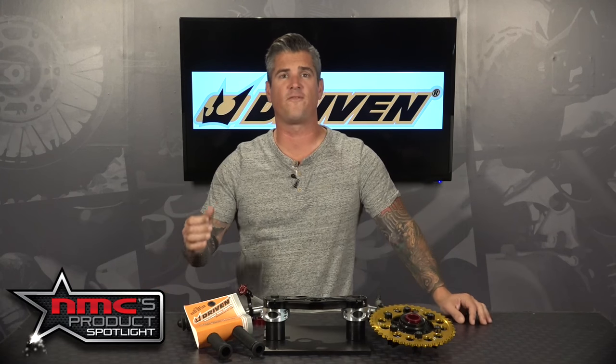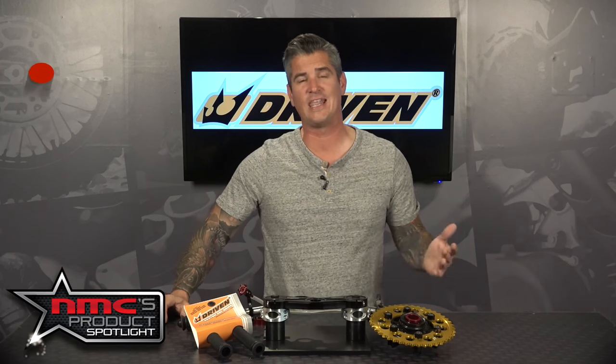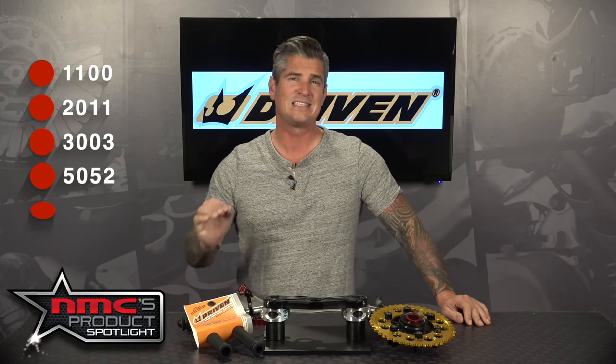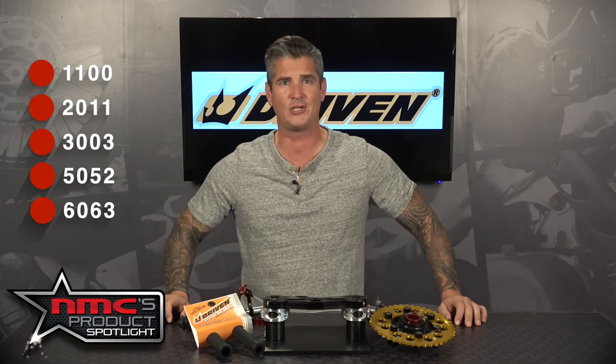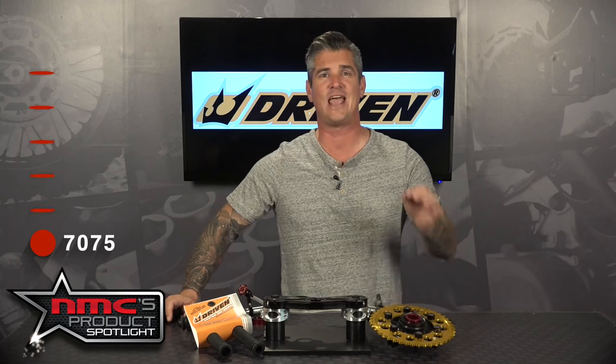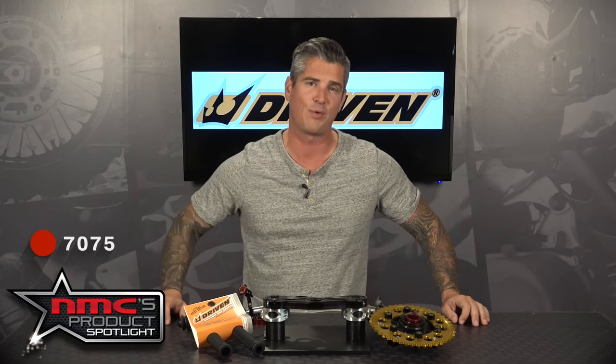Different grades of high strength aluminum alloy have been developed for use in different industries. 1100 is used for general fabrication. 2011 is general machining. 3003 is food and chemical equipment. 5052 is a marine application because it has an excellent corrosion resistance. 6063 is architectural applications, and 7075 is made for aerospace applications, and that's what you're getting in these sprocket nuts.